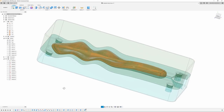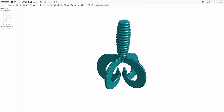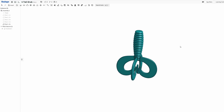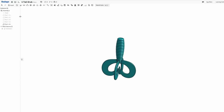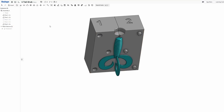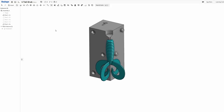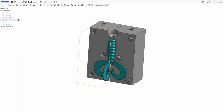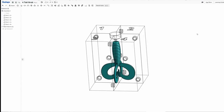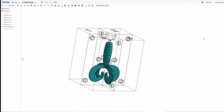For the four-piece mold I did that in another program. I am going to be trying to make this four-tail grub. I don't know if a four-tail grub has ever been made before — I've seen a two-tail grub but never a four, and there might be reasons for that, but that's what we're here to find out. Basically I started with four even boxes, cut the grub out of that, then added some holes, pins, and the sprue. Each piece has a hole and a pin, so you connect two halves, connect the other two halves, and then those go together to form the whole mold. Pretty simple. I'm going to go get these printed up and through the magic of editing, once we come back I'll be ready to inject.